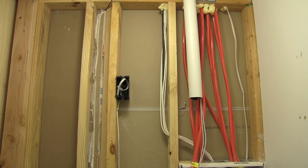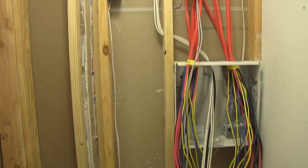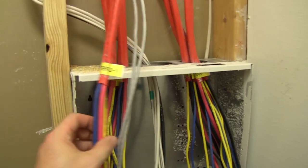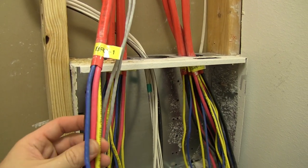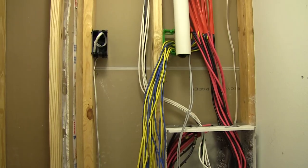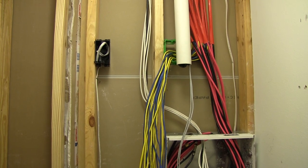Here you can see the result of the stud changes and the addition of the extended power receptacle positioned directly behind the wall rack. This will reduce the amount of cable on the external wall and give a cleaner look. Next, I need to separate the Cat 5 cable from the RG6 for each bundle. The consolidated media cable bundle made running everything ridiculously easy. The goal is to run the network cable directly into the rear of the wall rack, just like the power.